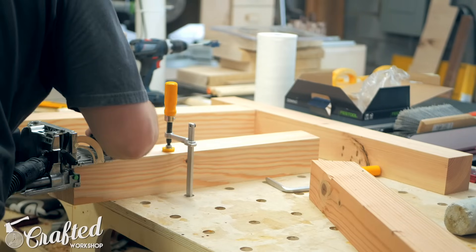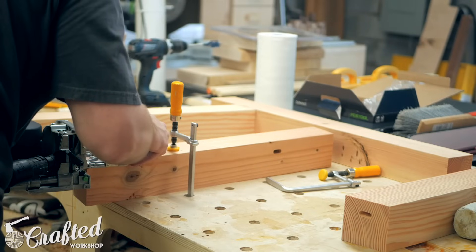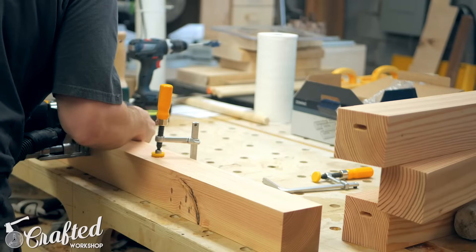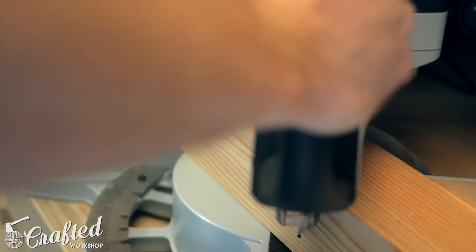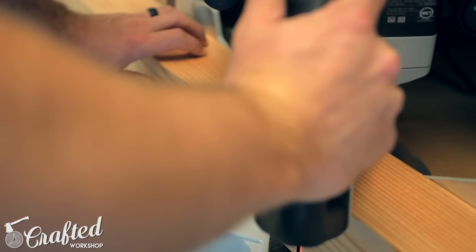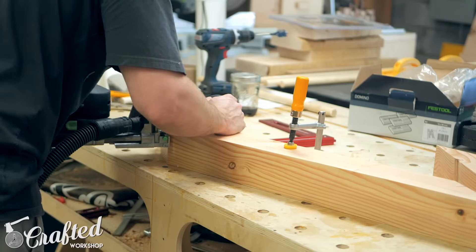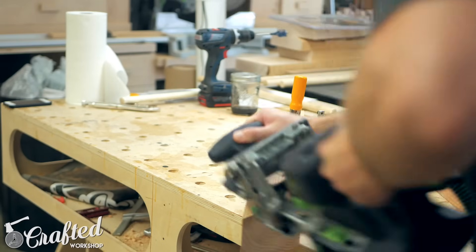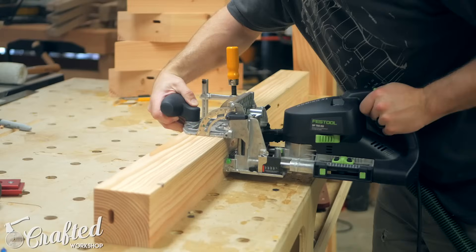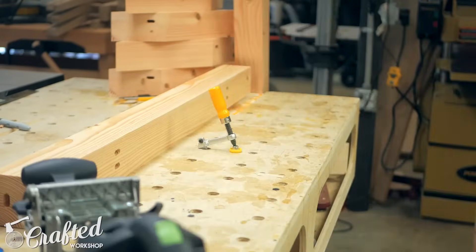To assemble the base I again called on my trusty domino, however there are plenty of other methods. Dowel joinery is a great option, as well as just plain old screws — a few 6 inch screws in each joint would give quite a bit of holding power and you could easily fill in the screw holes if you don't like that look. Once the leg joinery was cut we did a test assembly and marked the length of the truss supports. These are cut at a 55 degree angle — if your miter saw won't go to 55 degrees you could make these at 45 degrees. I cut the trusses to size and added domino mortises to them as well. After a dry assembly to make sure everything fit, I went back and cut a second domino mortise in each location so we could use two dominoes per joint, which made for an incredibly strong base.